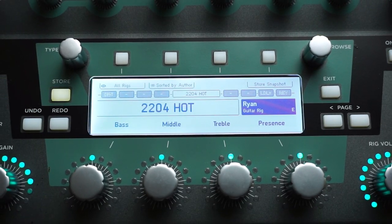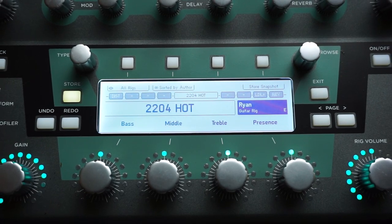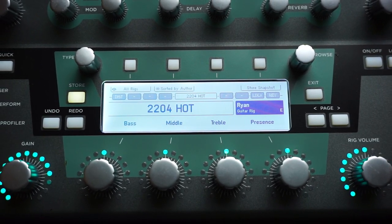And that output frequency response is going to very much look like that. Now, on the Kemper profiles, they seem to have the high end more or less figured out. There are certainly some improvements I think need to happen, like I talked about with the brightness of the pick attack and some of the things that I think aren't being fully represented. But the static frequency response is pretty much right on the high end. The low end is kind of wrong and backwards, in my opinion.